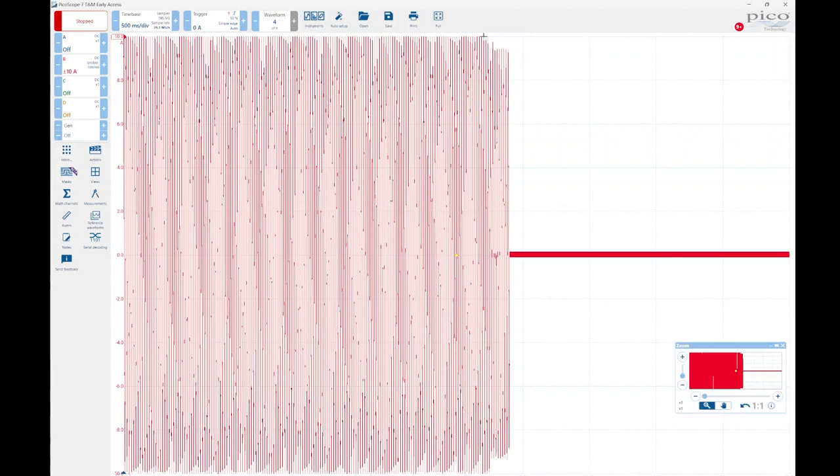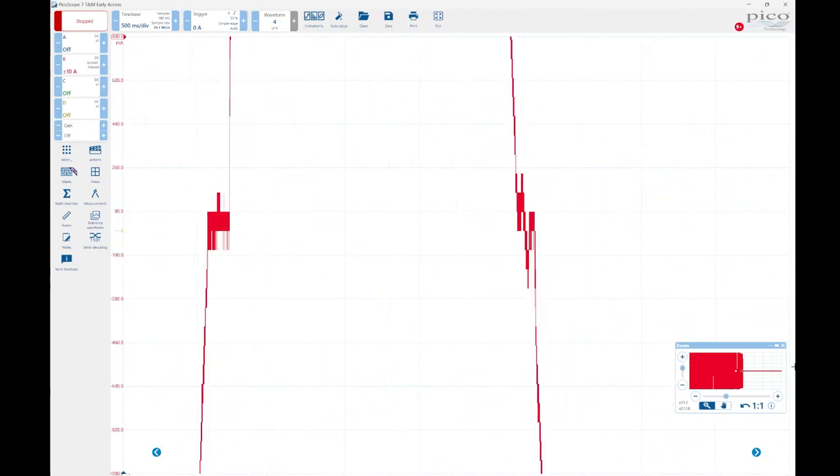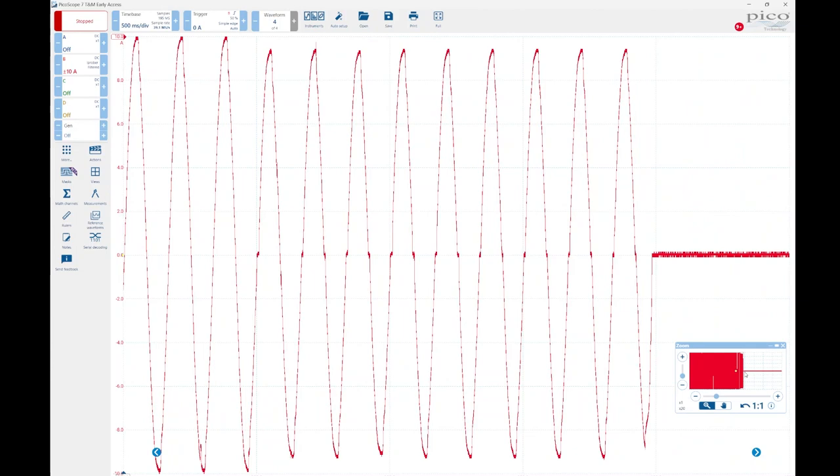Very similar. Once the arcing starts, you can see that peak current's actually a little lower. But more importantly, we have these discontinuities. I didn't do an extensive test here. You can see it actually took a couple more cycles. We're still way below the limit in the standard. So that's not an issue. And maybe the arcing was just a tiny bit different. I don't know. But you can see it's a very similar looking waveform and a pretty similar trip between the Siemens and that Eaton breaker.